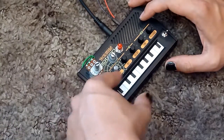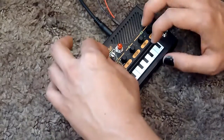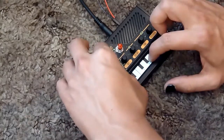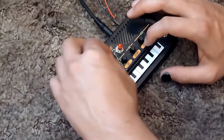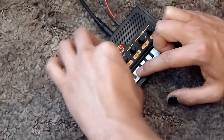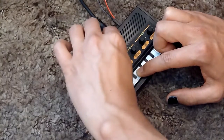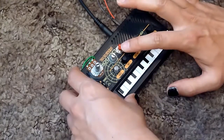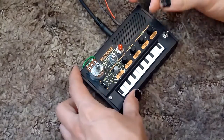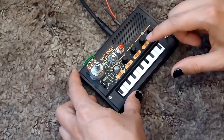So that's not a circuit mod — that is simply moving the pot so that it is more usable when you're doing a fast LFO and want to mess with it live. In addition to that, I added a momentary switch. As far as I can tell, it doubles the potential speed available stock on the LFO.